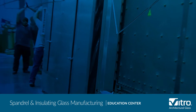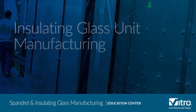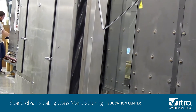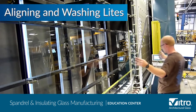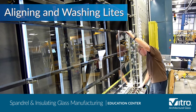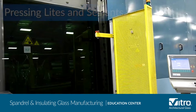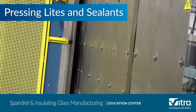This is a computer-controlled vertical insulating glass assembly line at United Plate Glass. Whether annealed, heat strengthened, or tempered, both lights are oriented, placed on the line, and washed again. A pre-sized and assembled spacer with a primary sealant on both sides is added to the first light. The second light is then mated to the assembled first light and spacer, and the assembly is pressed.